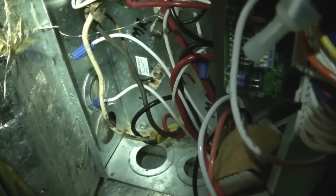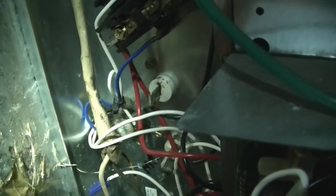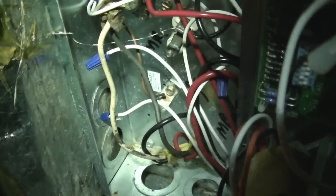What I'm doing here is I have the megohm meter on some of the circuitry in the air handler just to see if I can detect a ground. It's not really the intended use, but it'll give me a general idea if the system is grounded in some way. It looks like we're happy campers. I turned the breaker back on — it was off downstairs — and the motor took off. So we'll turn it back on, put the doors back on, see if the outdoor unit comes on. It might just be a nuisance trip from when the power kept coming on and off.